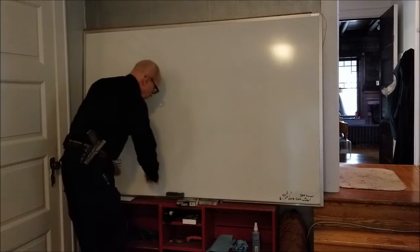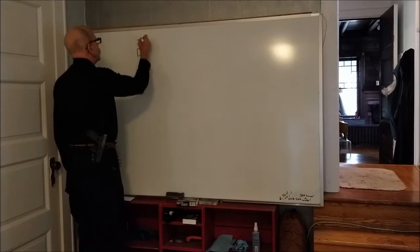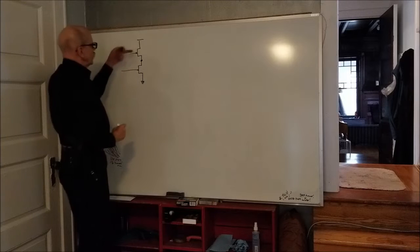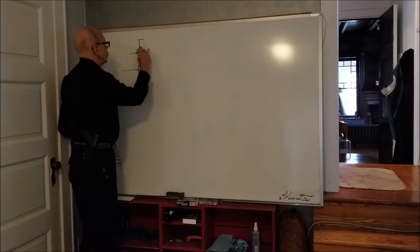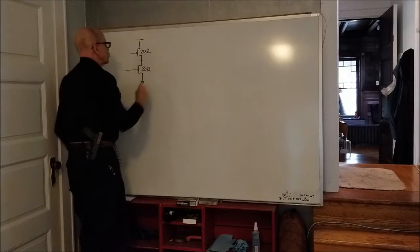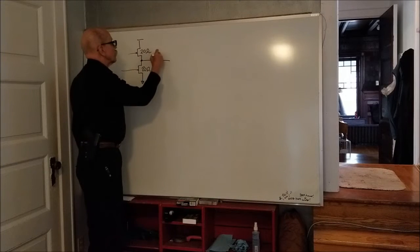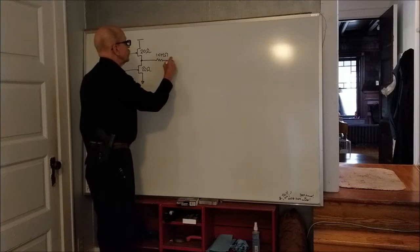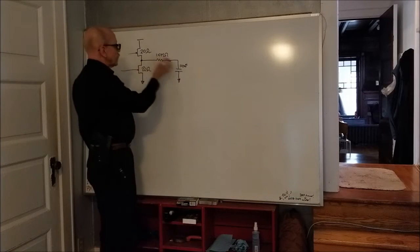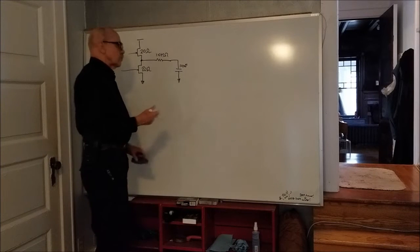All right, the principle in question, the goal is to sit here with something looking very much like one of our pad drivers. Each of these power FETs looks like 20 ohms. 20 ohms in saturation. So there's not going to be a lot of loss in those guys, especially since the currents are going to be vanishingly small. And then we go out here, and in this particular case, we're running a 10 megohm resistor into 100 nanofarads. All right, so the time constant of this whole circuit here is about 1 second, right? And so we would expect to cross our switching thresholds in about that period of time.